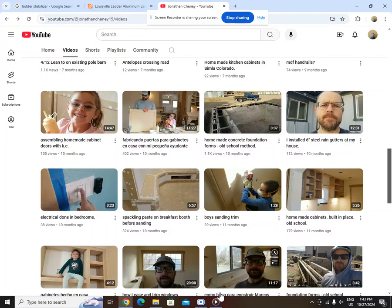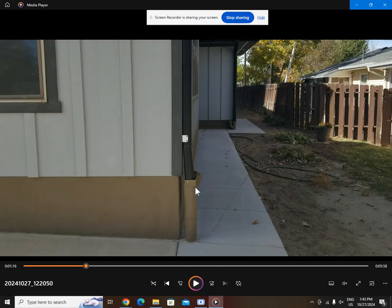This one ended up a little bit crooked when I was backfilling it — I didn't pay enough attention. But if that happens to you, don't worry about it, because you can make an angle cut on your downspouts and it'll flex for you. I couldn't get any kind of bracket onto the house because of the angle, and I thought that would look even worse. Just by bending the downspout with that cut I overcame that problem.